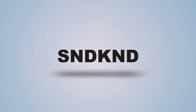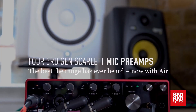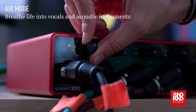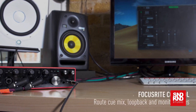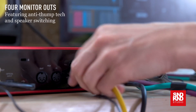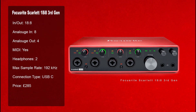We've reached our halfway point — in at number five we have the Focusrite Scarlett 18i8 third gen. It has 24-bit, 192 kHz maximum sample rate, four Scarlett preamps, phantom power, switchable air function, four mic pres under XLR/6.3, four line inputs, four line outputs, balanced jack, two stereo headphones, ADAT, MIDI, SPDIF, and USB-C. It's great for Mac and PC and comes bundled with a huge amount of software. Whether you're just entering the music business or stepping your game up, this is a wonderful product.